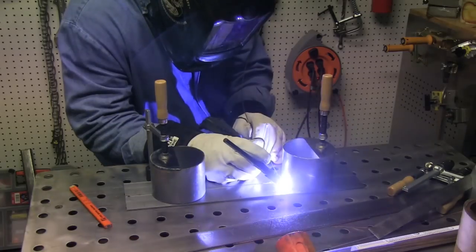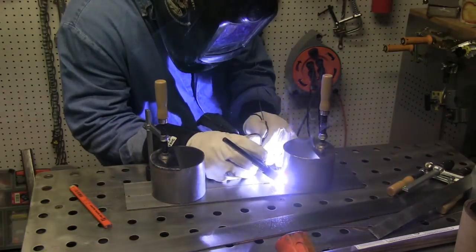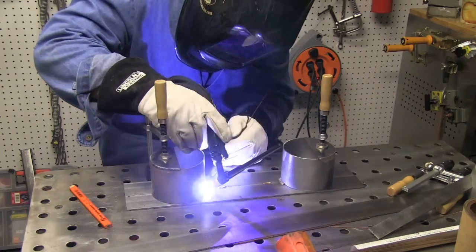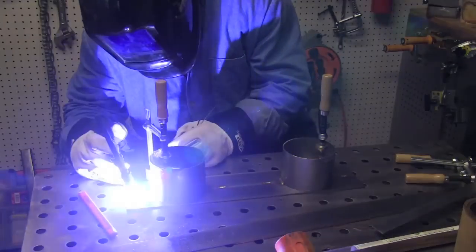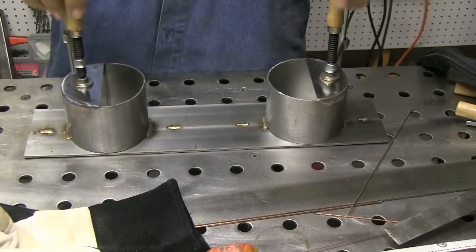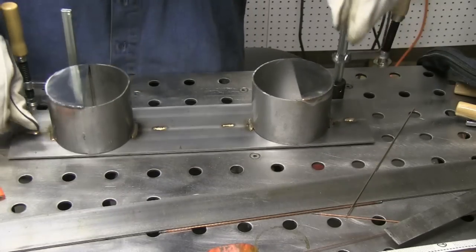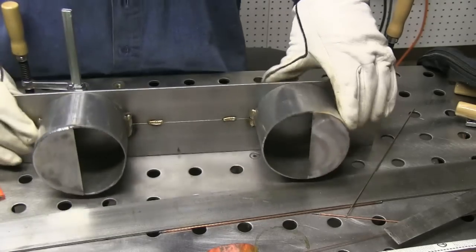Both ends of these — I've got two pieces of two-inch wide bar stock here, just butted up — I'm welding these pieces of four-inch tubing to, and both ends will actually be welded to the frame itself. That'll hold everything together plenty good, so I just need some pretty good-sized tacks to hold the cable reels up. It'll be plenty strong enough for holding the weight of a TIG torch, ground clamp, or whatever I decide to wrap on there.